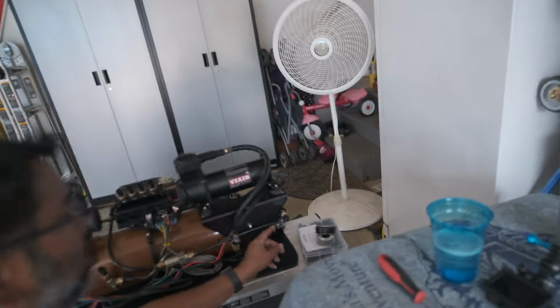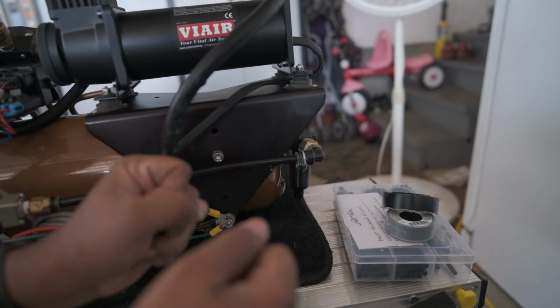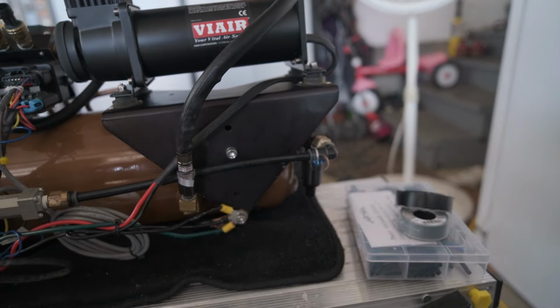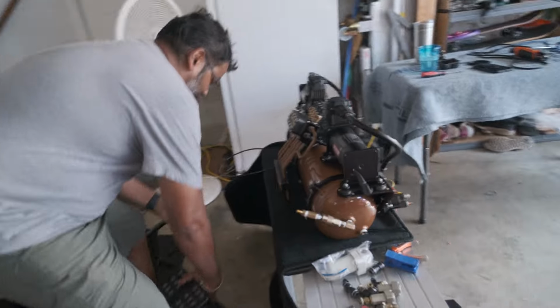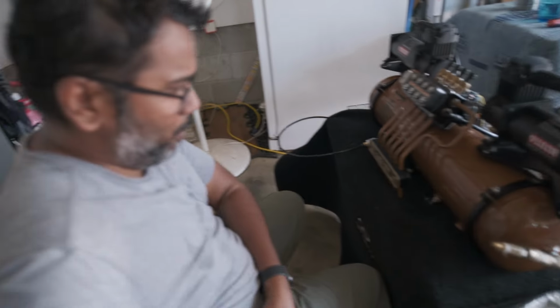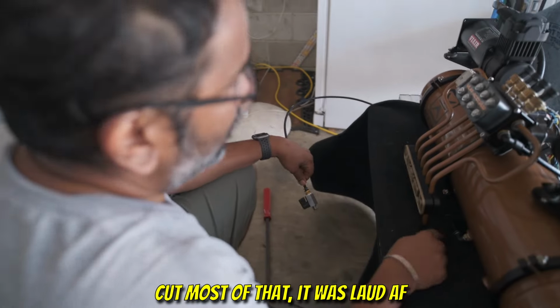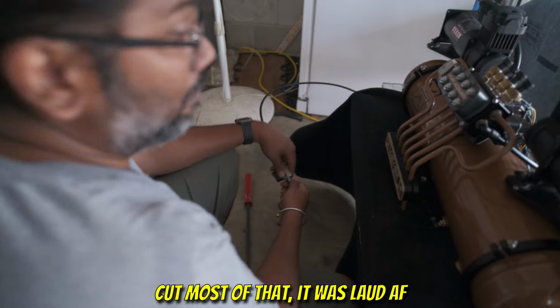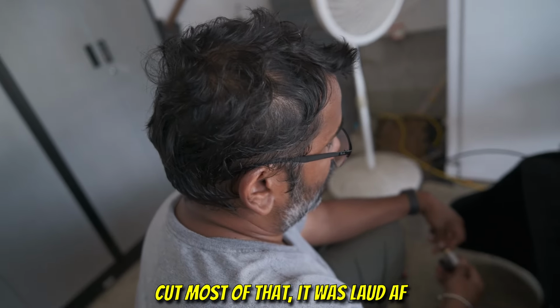Because right now with this pressure, this fitting is locked in hard. Also, although it's leaking, it's actually squished in really hard. So we need to release the pressure. And then let's try and reseat that fitting. I'll get soapy water off. Let's try our drain valve. But it's a good thing. We know that it's so low with the pressure of stuff coming out, we're gonna blow out some water and drain out the tank.